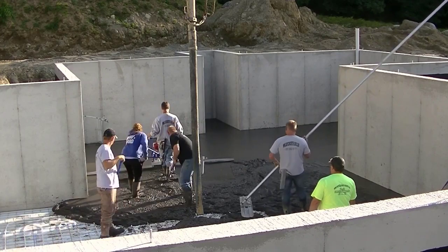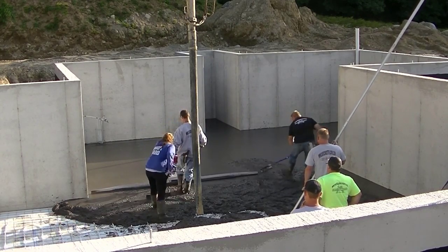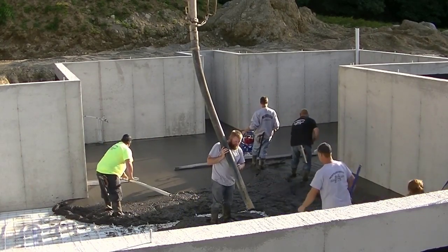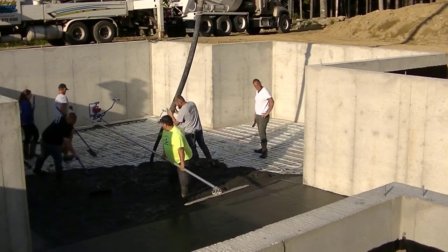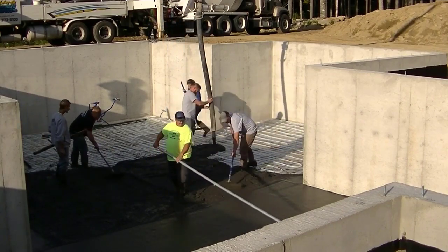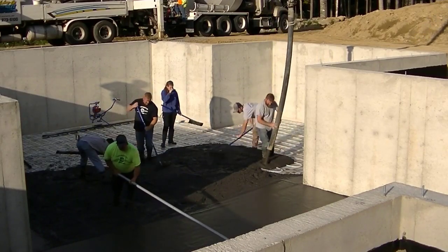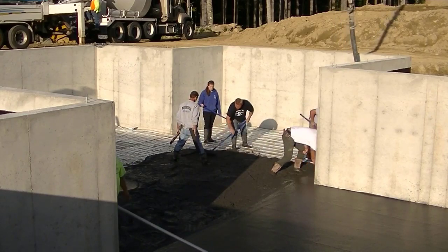You can see how dark that concrete is. As far as colored concrete goes, it doesn't really affect the way we pour anything — we're going to pour this floor the same way we would pour any concrete floor. It's just when the concrete dries; you can see how white or light gray those walls are — that's kind of how the floor would be without color. This one's going to be a lot darker than that. We got that first truck dumped out and now we're on to the second truck.